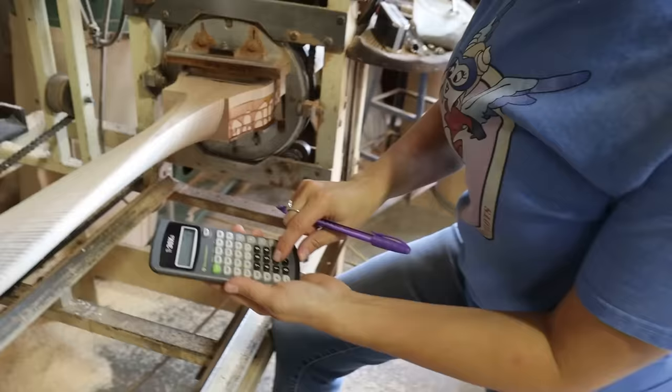So just feed it through here. This side needs to come around this side. Yep. So the basic premise of safety wire is not only to keep the bolts in, but also each of these is tugging them tighter. So as things move, they're not gonna back out. If anything, they're gonna get a little bit tighter. And so it's kind of an art form.